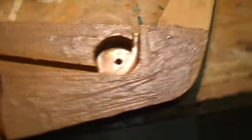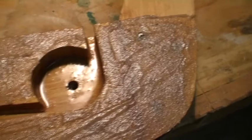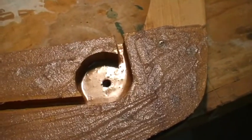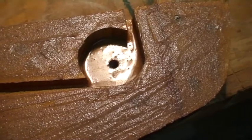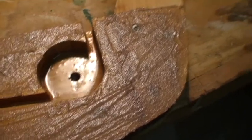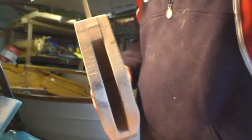The glue is now spread over the rudder stock. I've just spread it out, being very careful getting close to the edge where I'm going to put the sheave inside, because we don't want too much glue squeeze-out coming in around there — it may actually foul the sheave and the line going through it. So I've thinned it out near the edge; we'll probably get a little bead coming out on the inside, but we don't want too much squeeze-out.